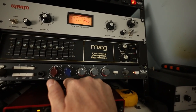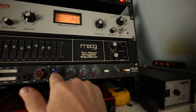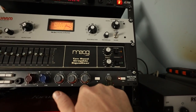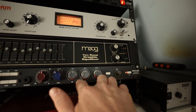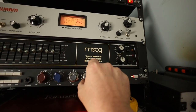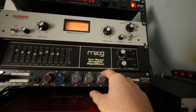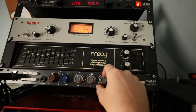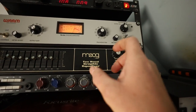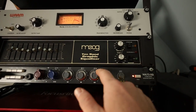It's got a high-pass filter so you can cut out the subsonic frequencies — I usually leave it set at about 80 Hz for pretty much everything I record. And it's got a three-band parametric EQ with shelving EQs on the bottom and top and a bell EQ in the middle. The EQs sound fantastic whether you're scooping or boosting, and I never hesitate to boost even the high frequencies — this preamp just sounds really musical.